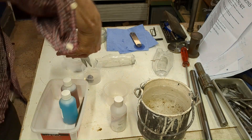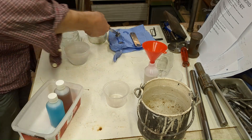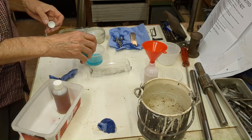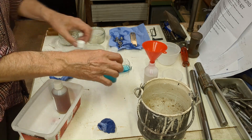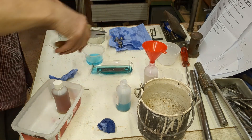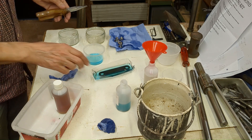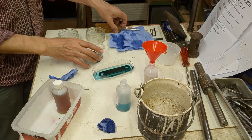I've used this little chemical blackening kit a few times now and it works remarkably well. First the parts are washed in an alkalised solution, rinsed in tap water, and then immersed in the chemical blackening solution. I'm always surprised how quickly that takes effect. After about 10 minutes it sits in that, then rinsed again in tap water, then into the dewatering oil. The process is very quick and it always seems to come up with a good result.